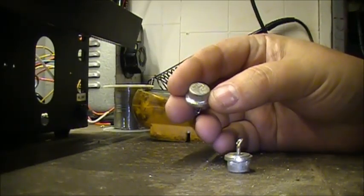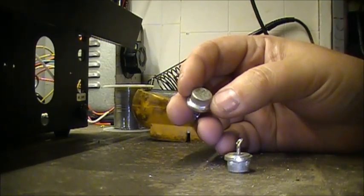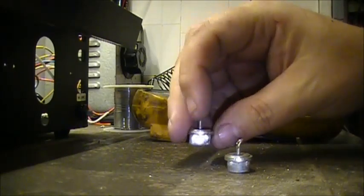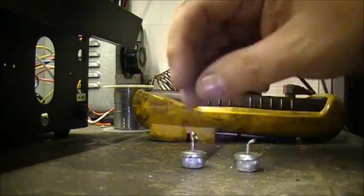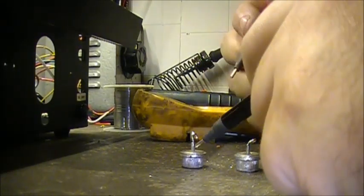Okay, boys, another reason why this power supply died. Two of these 35 amp diodes in the back of the unit, 1N3498R, I believe they are. I just removed both of them. And one of these guys has actually shorted out. So we'll test this one over here first.